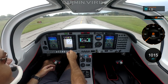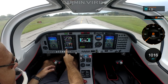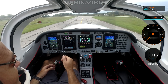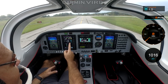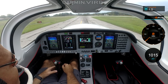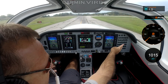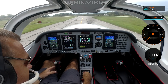Circuit breakers. We also have trim on another page here — that's on our engine page. It even has a trim function. We've got rudder — we'll go ahead and roll in some right rudder for takeoff. Our aileron trim's a little bit to the right, but that's about right in cruise. That's where it needs to be, and it shows the elevator a little bit up. So we're good there. Check our fuel page. We have 39.4 gallons. This plane holds 82.5, which is good for about 1,300 nautical miles — be perfect for tonight. We've got plenty of fuel. Trims are set. Circuit breakers all in, except for my AOA — I haven't configured it yet. It takes a little bit of work to configure it, so it's not hooked up yet. We'll work on that later.